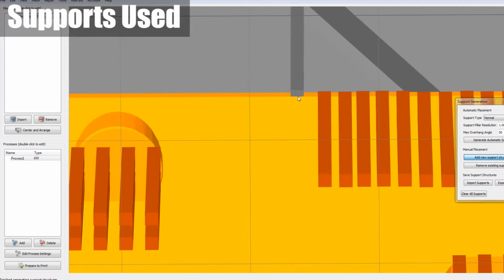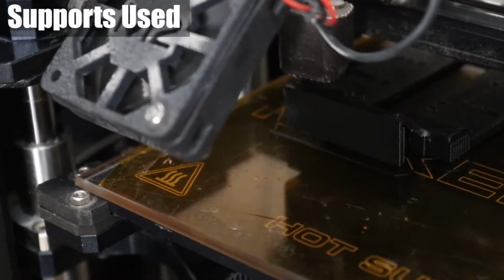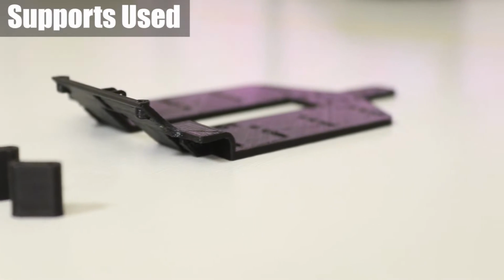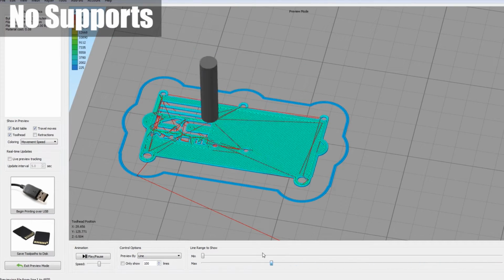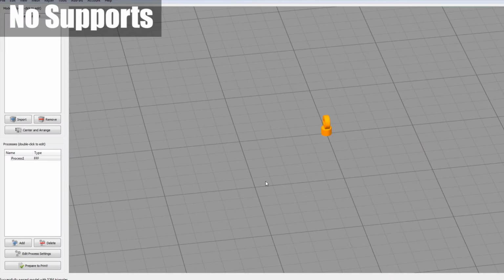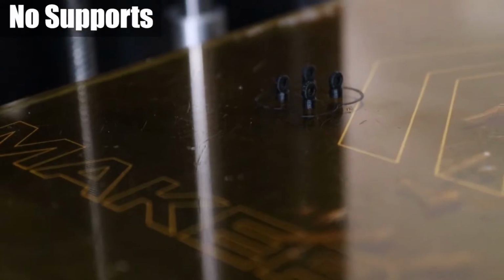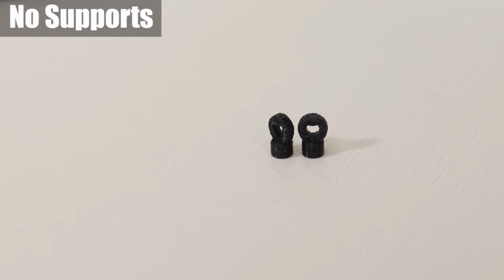Most of the parts I printed using a 0.15mm layer height. I also reduced the layer width when printing some of the tiniest parts, and make sure every part is securely attached to the bed with no warping. At some point, I do want to make a few tiny modifications to the design, such as modifying the opening on the steering center link ends to be a teardrop shape instead of a perfect circle to avoid the flat top that you see here.